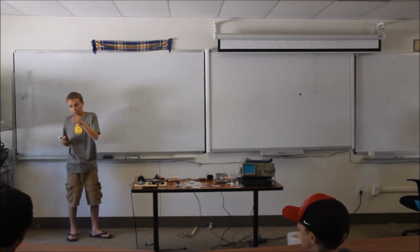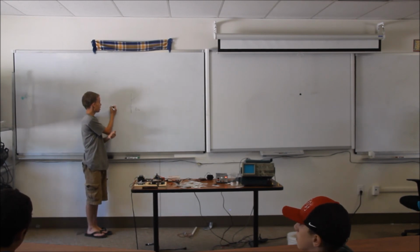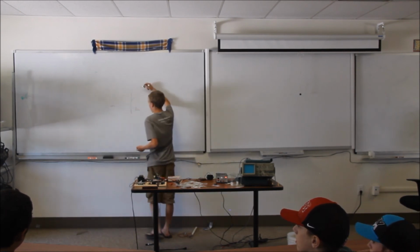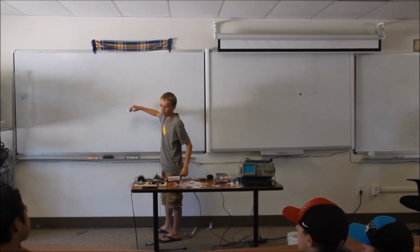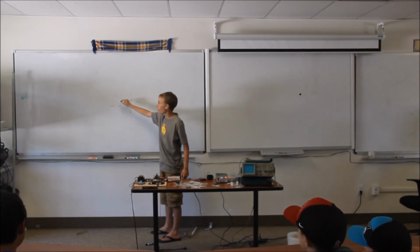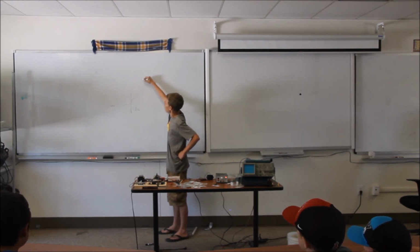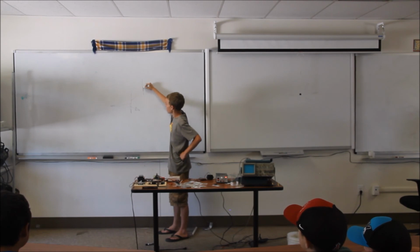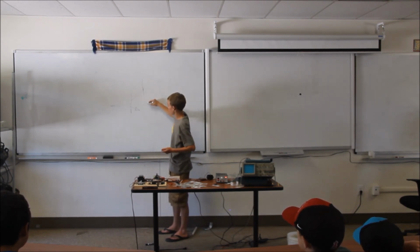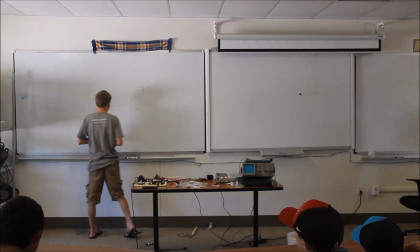And so in the speaker amplifier that I was talking about before, if we have the tiny little voltage of this, it's pretty small, this will allow this switch to turn on and off in the same way this little sine wave is turning on and off over here. And so it could allow a lot of voltage and then a little bit, and then a lot, and then a little bit to flow through here. And it creates a huge, bigger sine wave. So you can use a transistor as an amplifier.